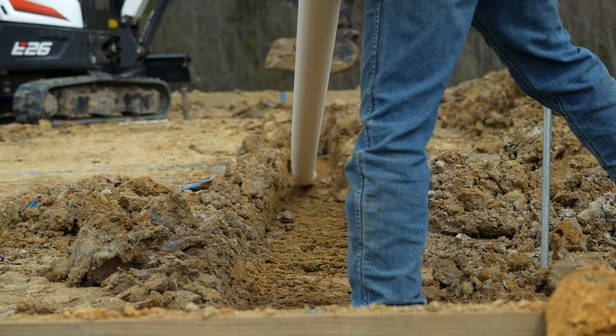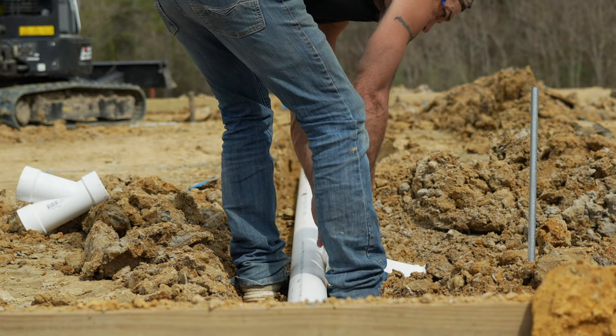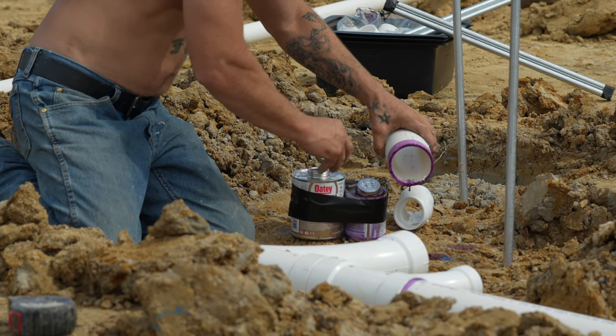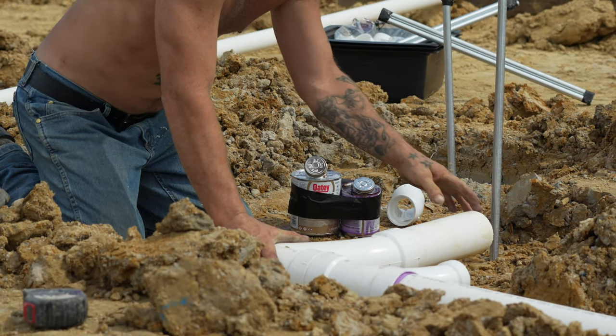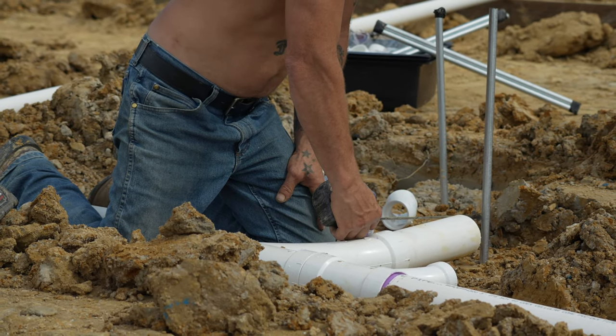The trunk line is 3-inch Schedule 40 pipe. Next, we will install the sanitary tees that will go to each plumbing fixture. Locate your plumbing stub ups. Use your floor plans to figure out how far from the edge of the forms your stub ups will be. The fixture locations are staked with 1/2-inch metal pipe.